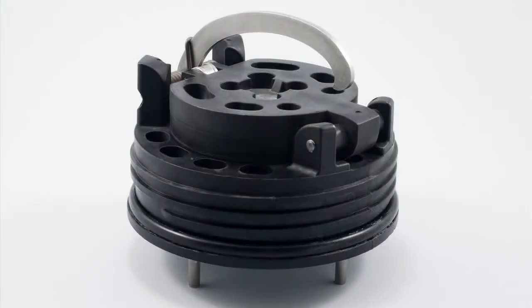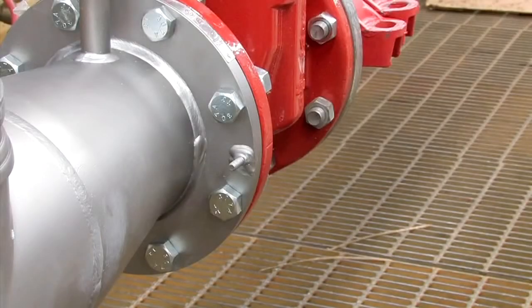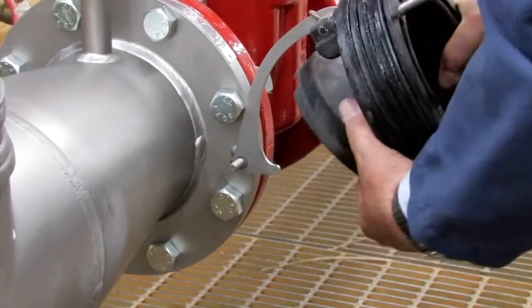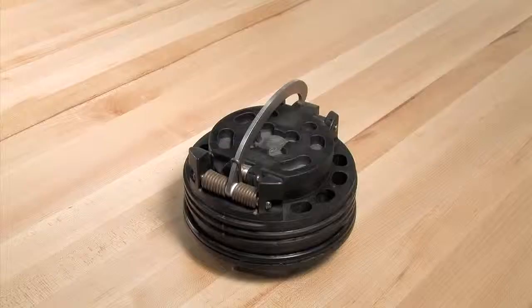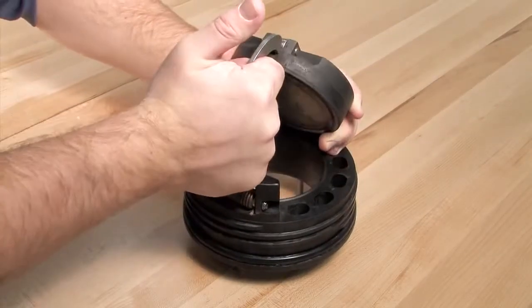Due to the heavy spring load, to open and inspect each of the checks found in the six-inch assemblies, as well as the number one cam check found within the two-and-a-half and four-inch 994 assemblies, first slide the cam arm over the opening stud on the outlet flange and gently pull the arm back. Lock the check open by placing the arm against the notch found on the check clapper. The number two check found within both the two-and-a-half and four-inch 994 assemblies can be opened by hand.